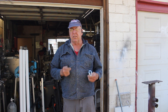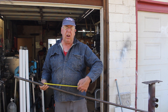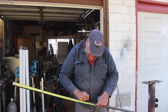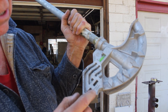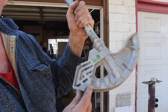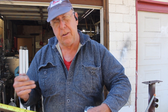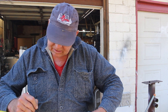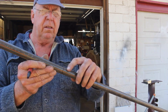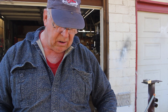For the chair frame we're going to start by building the back using seven-eighths steel tubing and we'll bend it with a conduit bender. I want it 32 inches tall, so we'll put a mark at 32. Looking at the conduit bender, there's a little arrow with a note that says 'stub six inches to arrow.' So if we want the top of the back 32 inches tall, we subtract that six inches, bringing us back to 26. That's where we put the arrow, do the bend, and the top should be on that line.